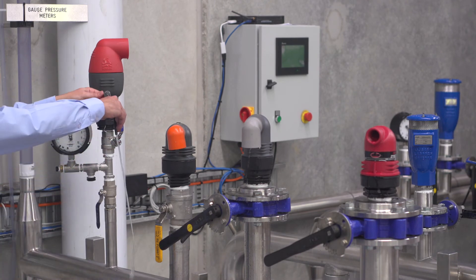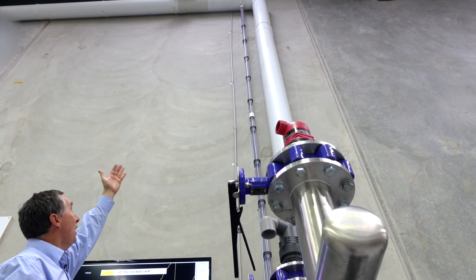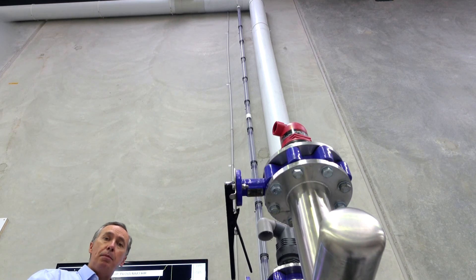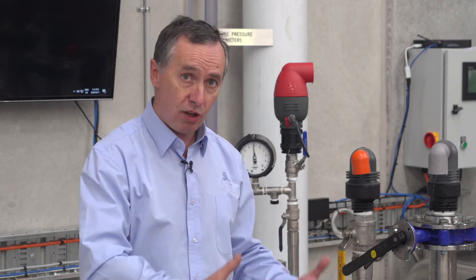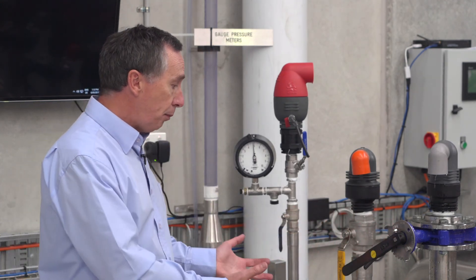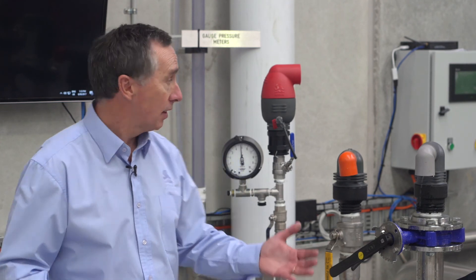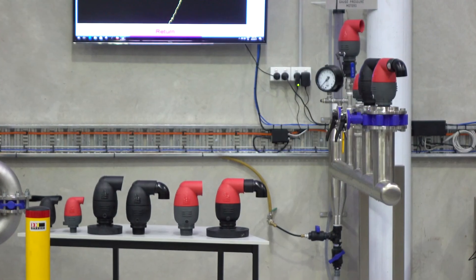There's plenty of water pressure in the valve — it's just a standard valve taken off the shelf. When you look at the clear tube and see that at five meters higher than the valve, that's the amount of additional energy — compared to a Bermad valve — that you need to make these valves seal. It's not that they're at fault, but what that means to you as a designer is: you don't have to have a pump that produces that much more water pressure to make the valve seal, you have less risk of parts of the pipe draining and recharging with potential water hammer, and finally from a health and safety perspective you've got a valve pit that is dry, without weed growth, soil erosion, or the potential for vermin. Bermad valve is optimal in that position because it doesn't require much water pressure, and that's what we've demonstrated at this low pressure facility.